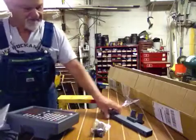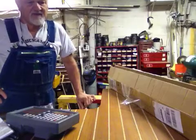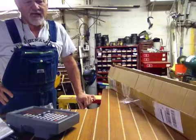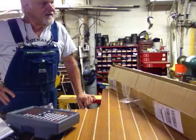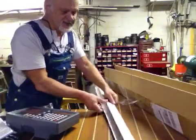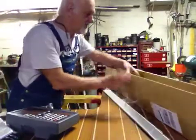Let's open up the scales. When you order, you have to tell them what size scales you want. For that price — $285 — the scales, they'll give you up to a thousand millimeters. For the Bridgeport, that's not the total travel of the scale; you have to add 142 millimeters on top of that for mounting. So one scale was 48 inches, another was 10, and the other was 20 inches — all within the range for $285. They also give you mounting hardware and shields for the scales: angled aluminum brackets to protect the scales from metal chips. There are three of them.